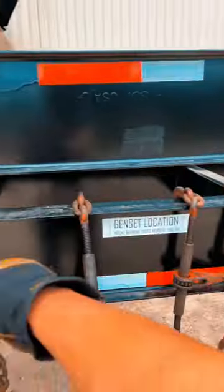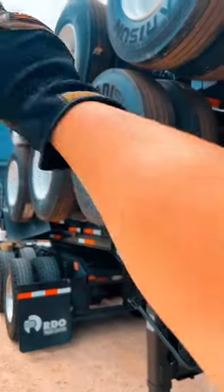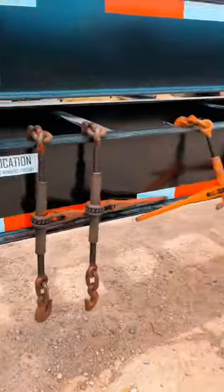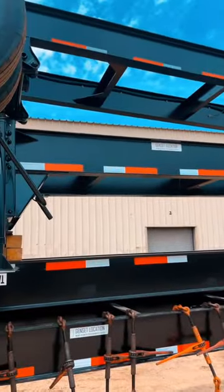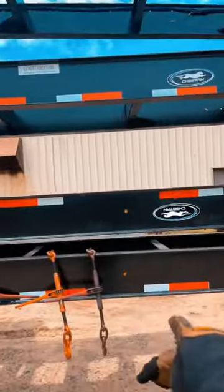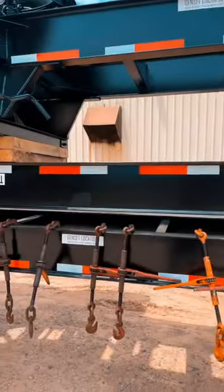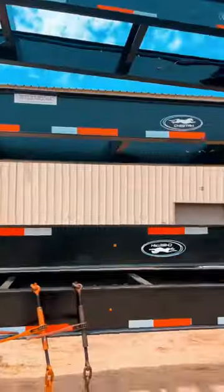What I like to do first is get all my binders laid out and get them all undone — figure out which ones are working, not working, which ones need to be greased. That's part of step two: getting all your stuff out in the open so you know what you have. I have two sets of chains. One's going to go here in the middle, one's going to go on the back. I have another set up there and it's going to get a big X in the front. I like to get all the binders opened up because I just used these the other day and greased them before I put them away — they all work perfectly. I also have another four sets of binders. A lot of guys like to put straps on these. You don't strap on the end, guys — you can't do that. But a lot of guys like to put straps in the middle. So for the sake of the video, I'm going to do straps: an X in the back, one chain over the center, and another X in front. And right here I'm going to put big four-inch ratchet straps.